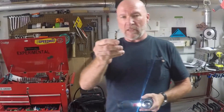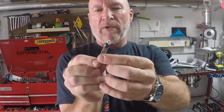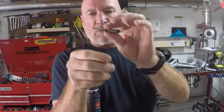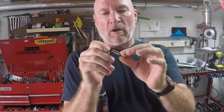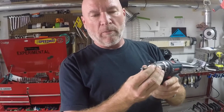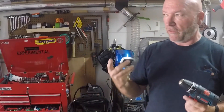I've been using these spring-loaded drill stops — you set them with an Allen screw onto your bit. They come in different sizes: 3/32nds and 1/8-inch. When you're drilling holes in sheet metal you're not bottoming out your chuck against the metal and making a round mark on it. They just make your hole and stop — no mark on the sheet metal.